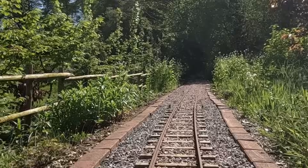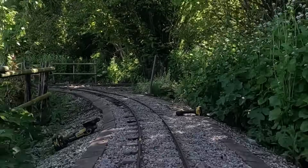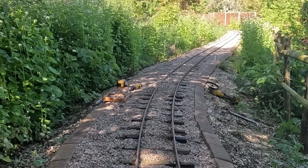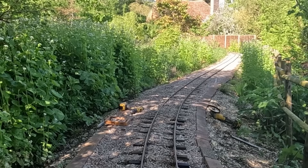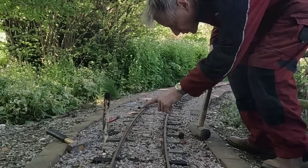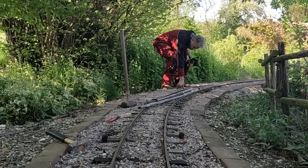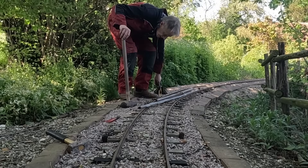See how it feels. I can't go as fast as bongo up here but we'll do our best. So what I now have to do to keep it in place is to put some little spikes hammered down into the ground to hold it - those ones I had before weren't really long enough, so I'll get some slightly better ones and cut some little lengths of pipe and bang them into the ground, and that will then be the job more or less complete. I've moved this joint across a fraction, I'll just hammer this post in. You can see we're about three or four inches - ten centimetres - across that way now, which I think is what I wanted to do. I think I've worked my way down there pegging it where I want it to be.